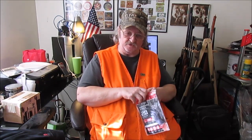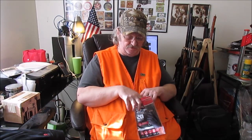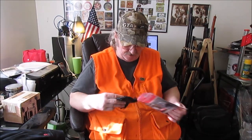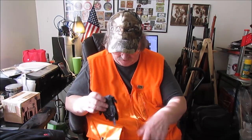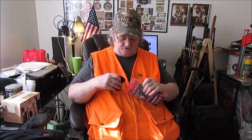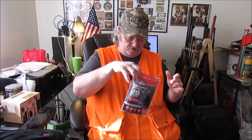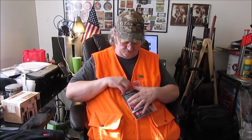Once the oil is sucked into the metal you can't get it back out, so I just stripped the whole thing and started all over again. I didn't mind too much because I had enough emery paper left from polishing the brass on the Ultra High Kentucky rifle. I went 400, 600, 800, 1000, 1500, 2000, and 2500 grit wet and dry emery paper.